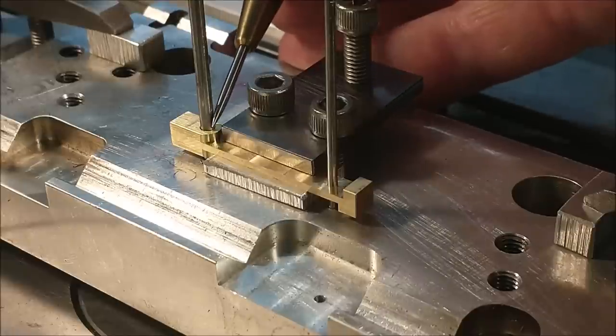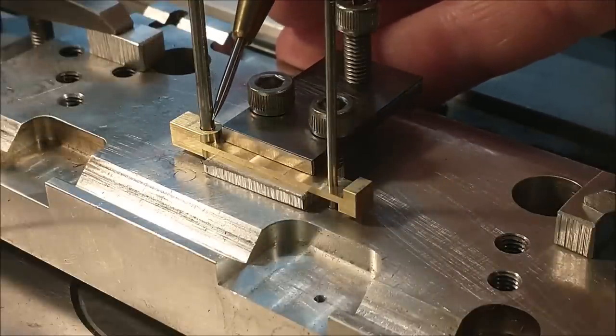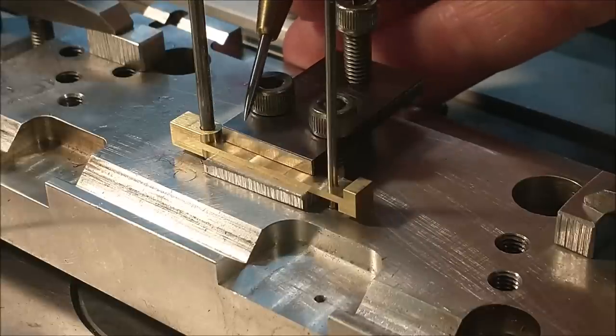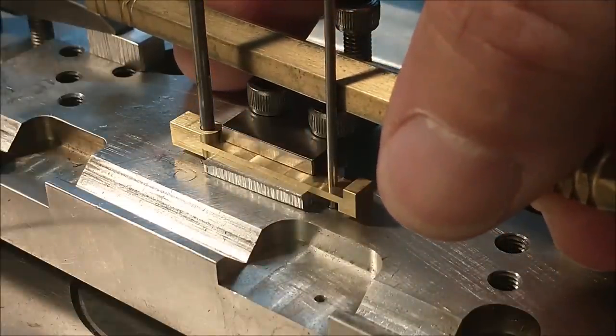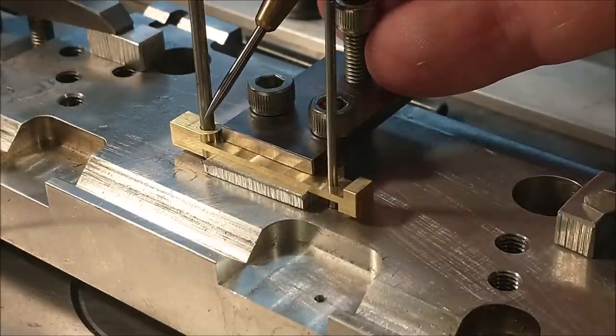The orientation of the square going through where this large pin is at a 45 degree angle. Well, it's a lot easier to control a broach if its square moves as opposed to diagonal moves. So I'll need to index this part at 45 degrees with the broach face set true to the x-axis. That'll give me a lot more control over the feature right here.